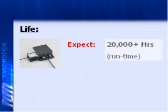With this frictional system, you've got a ceramic finger rubbing a ceramic strip. Do either wear out? They'll definitely generate some particulate. Keep in mind that particle count is very low and very small in size. For most people, it's not even a concern for them to even bring up. But it does go to the life expectancy of the system. Typically, we'll rate our motors for 20,000 hours of operating time. That's assuming a high velocity performance and high duty cycle. If you scale the velocity back, scale the duty cycle back, you can get much more life out of it.